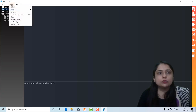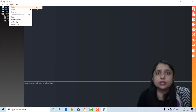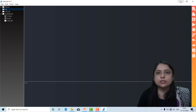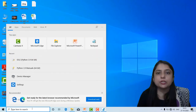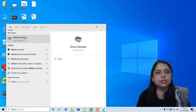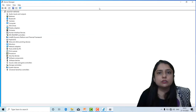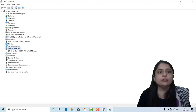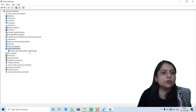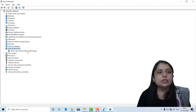Next, you have to select the COM port — here it's COM3. If you have not installed your driver properly, you will not be able to see COM3. You can check whether the driver is properly installed by going to Device Manager. Under Ports, you should see the Silicon Labs CP210x USB to UART Bridge port. When you install the driver, this port will activate.